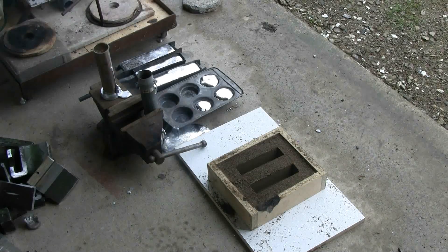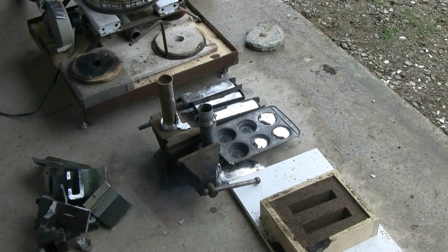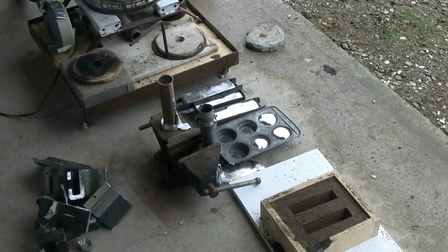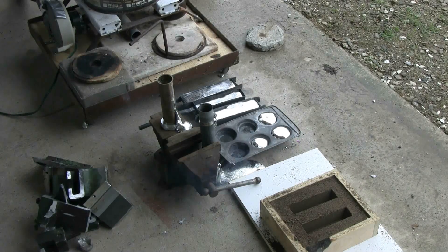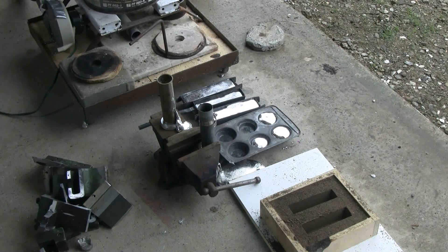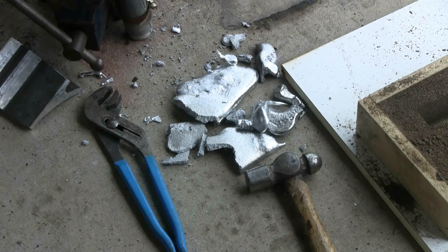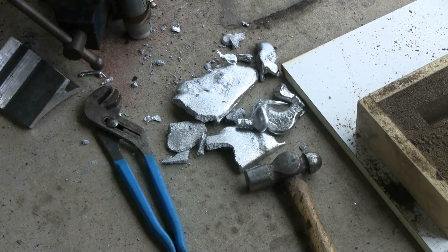While the bars and muffins went perfectly, I didn't have enough aluminum to reach the sand mold, but there's a dual fail on the cylinder molds. One of them evidently had a hole in the side; the other one I didn't have tightly sealed enough at the bottom and it leaked out. So I'm going to be melting a bunch of aluminum from the floor — I'll get that back in the crucible and we will do another round of pouring shortly. There is the aluminum that leaked out onto the floor; I'll be putting it right back into the crucible and continuing.